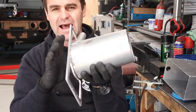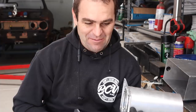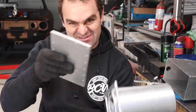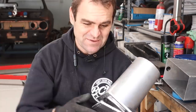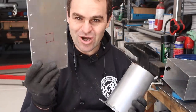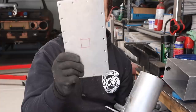I have tacked on my internal part to this top plate, just to get it roughly in place. I can go around and weld it on later, but I want to bolt the top plate on before I do that. And I have just realized that I messed up. Basically when I bolted this all together I did it with this plate on this side and didn't really look at where they were and drilled and tapped out all these holes. So now the holes don't actually line up. Even though I used the drill press, some of them must have skewed slightly, and that means one or two of the holes line up and then a bunch of the others don't. So I have to make a whole new top plate. I'm going to keep this one and just make another top plate.